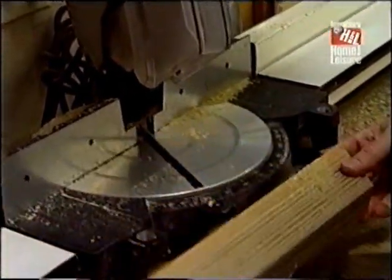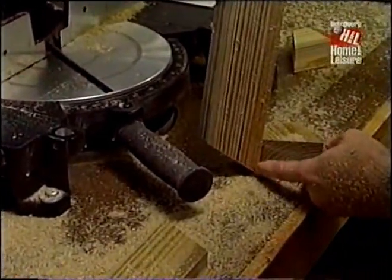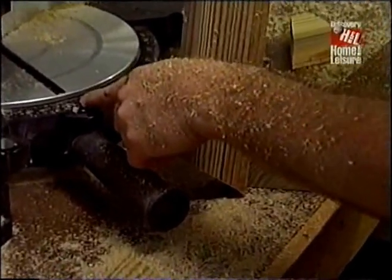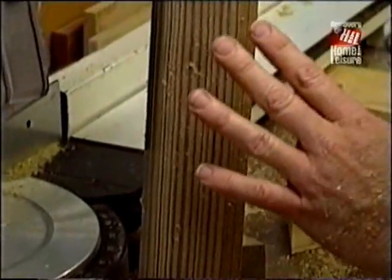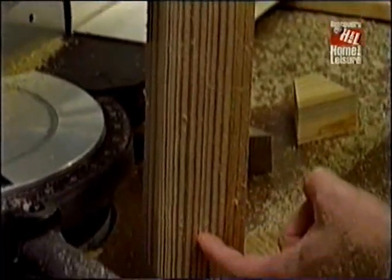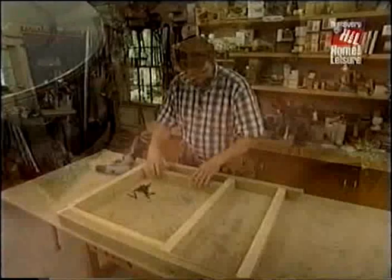These 4 studs are the corner studs, and I've cut them to meet the slope of the workshop, which is a 7/12 pitch, a little more than 30 degrees. Now, you might notice that I'm using pressure-treated material. Even though the cupola will be waterproof, if any water got on the inside, it would want to wick up through the bottom of these studs. With the pressure treated, that won't be a problem.